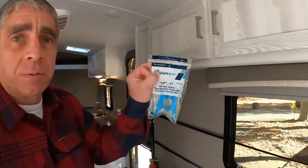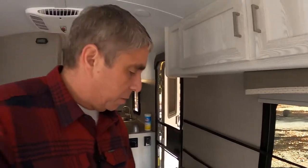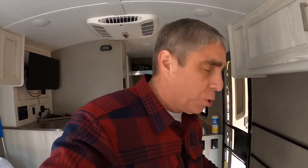In order to attach that, I'm going to have to cut the PEX line, so I have this inexpensive PEX tube cutter. It's supposed to work for half-inch up to one inch. I don't want to cut too far away from the faucet — I don't want to cut too much of the PEX line out.